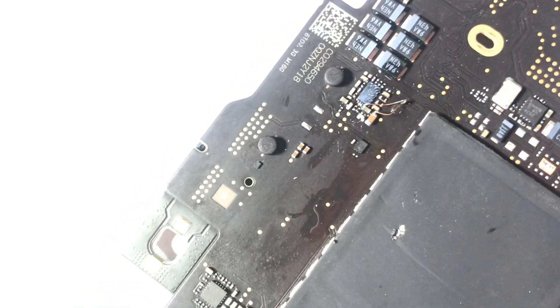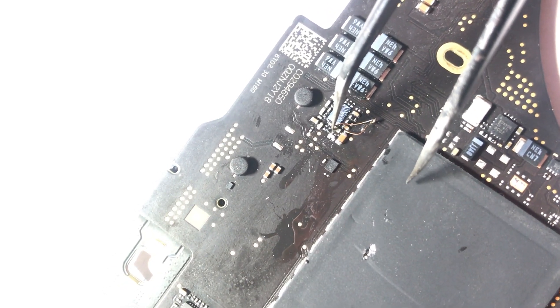There is no help on the internet, but then I found a very good clue on this board. I found a resistor in this area — this is my modification. There is one resistor in this area, very tiny, very hard to see, but I can see this resistor was blown. I will show in the schematic what resistor it is and its position number. This is the board view and here is the position.